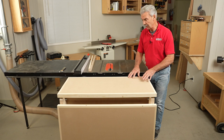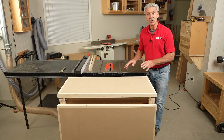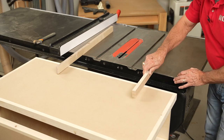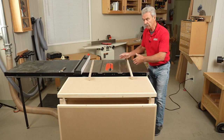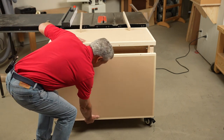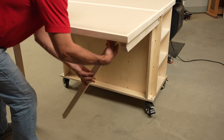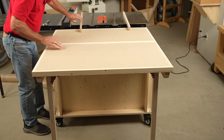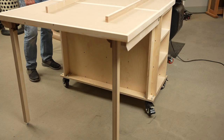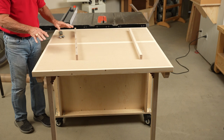Here is our completed outfeed table in position. I'm about 6 inches away from the back of the saw because of the position of my dust port at the bottom — yours may allow you to get a little closer. We measured at the start to make sure the outfeed table is about an eighth of an inch lower than the table saw height, so material coming off won't bump the table — and now you can see that's right on point. Lastly, I adjust the drop wing so the tabletop and drop wing are even. There is an adjustment on the bottom of each leg, and I've made that adjustment with a wrench. This drop wing doubles the size of the table — this is a terrific outfeed table.